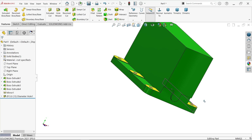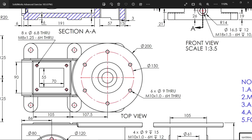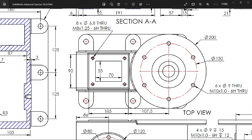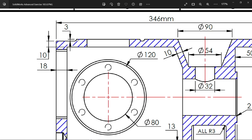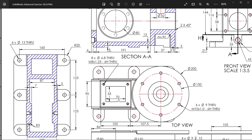At the top we are going to add a circle of 200 millimeter diameter, at a distance of 346 from the outer edge. There is also a rectangle 90 by 105, located 107.5 millimeter from here to here. The thickness here is also 3 millimeter.